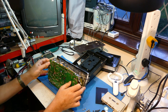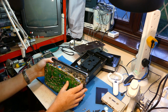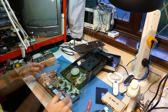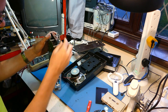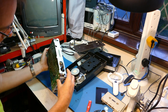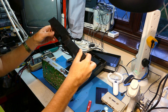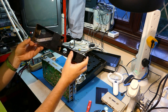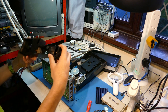First challenge is to work out how to power it. I'll probably work out what the polarity is on the battery hatch and then connect directly to the tabs at the back. Having briefly reassembled it, my plan is to feed the power into these two tabs at the back. But I need to get the polarity right — I really do. I also need to know what the voltage is. Maybe I can get both answers from here. How many batteries did it take? What kind of batteries did it take? I think it took D-cells, and it looks like it took 1, 2, 3, 4, 5, 6. So that's almost certainly 9 volts.